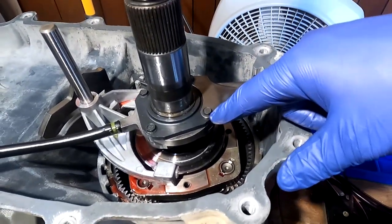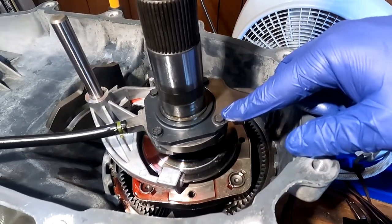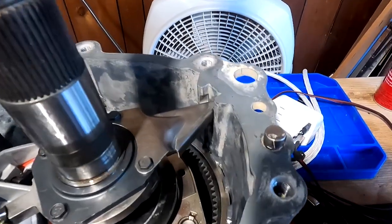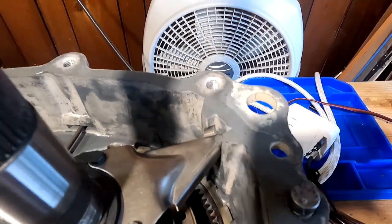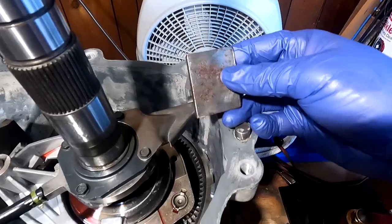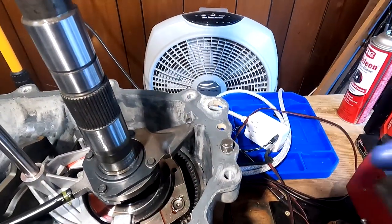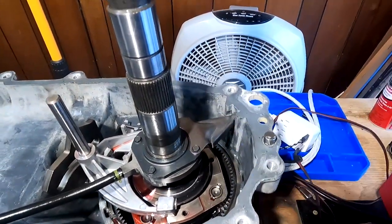The big idea: I'm going to cut up this piece of 3/16 flat bar so it almost perfectly fits into the pump arm groove. I'm going to cut it width-wise to fit down into there, then cut off a certain portion of the pump arm and weld this piece of steel to it. That's going to evenly spread out the force of this arm so it doesn't continue to dig a groove into that side of the case.